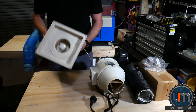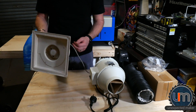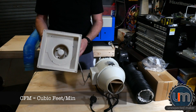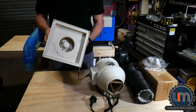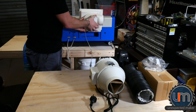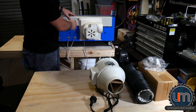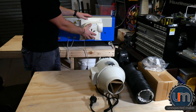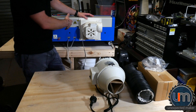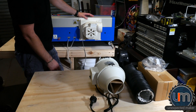The first thing I want to discuss is this atrocity. This is the extraction fan that came with the unit. It's not necessarily a terrible fan — I believe it only does about 88 CFM, so it's not super powerful. The problem is it doesn't actually fit the unit. It sits too high, it's in the way of the lead for the laser, and it just doesn't mount very well. It's really loose, so what people have been doing is gaffer taping it to the actual cutter, and then they can't open the laser door and have to rip it apart afterwards.